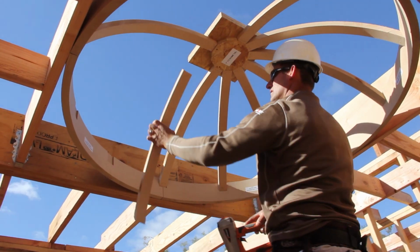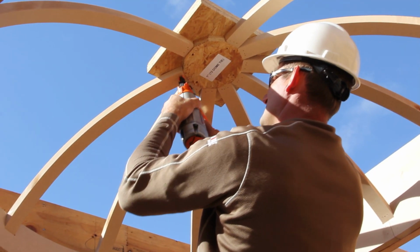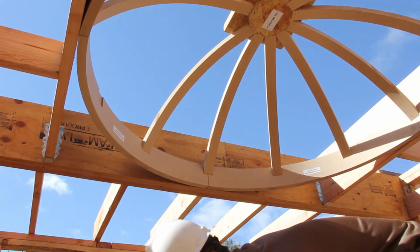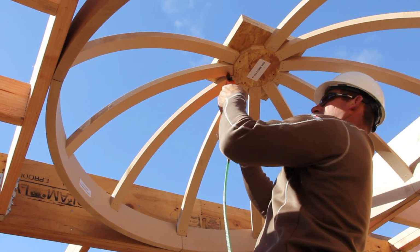All right, once Paul finishes all the rafters, you'll notice it's easier to understand how the rafters are equal distance apart. As part of the kit, we put in a template for you that you can trace on the drywall so that you can perfectly lay these triangular curved pieces from butting against the ring up to the very center as it tapers into the middle.